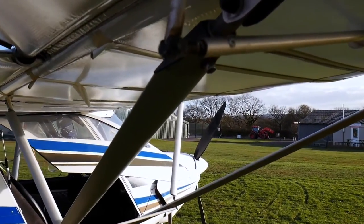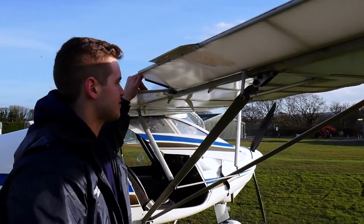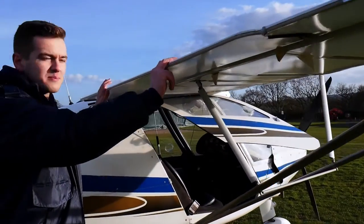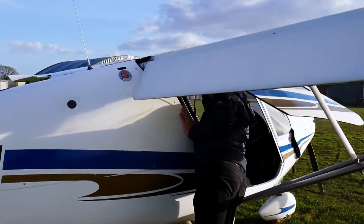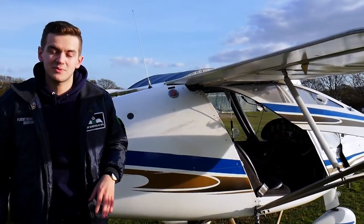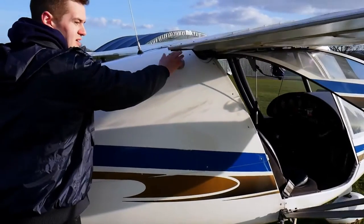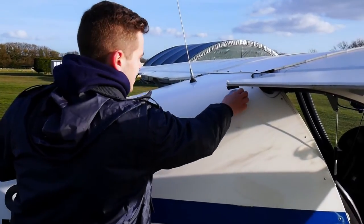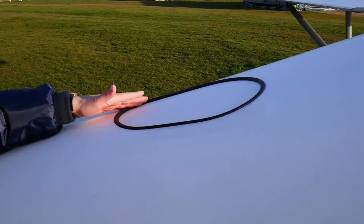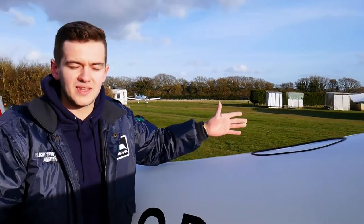Being a fundamental part of flight, like the elevators and flaps, the bolts have little safety wires attached to them. That's one of the main things we like to check — that they're nicely greased up so they move freely, and that those safety wires are in there. This section here is the flaps. There's a little lever inside the cockpit that we operate the flaps with; it's not in a normal place, which is one of the main features people notice about the C42. Over here we've got our fuel filling point — nice and red, can't miss it.